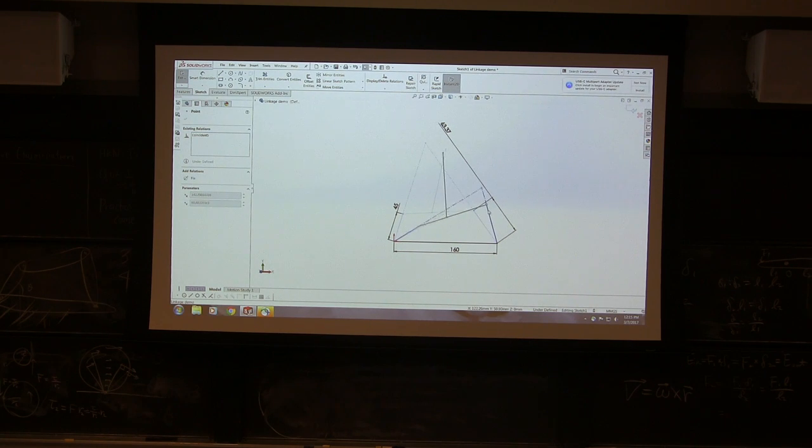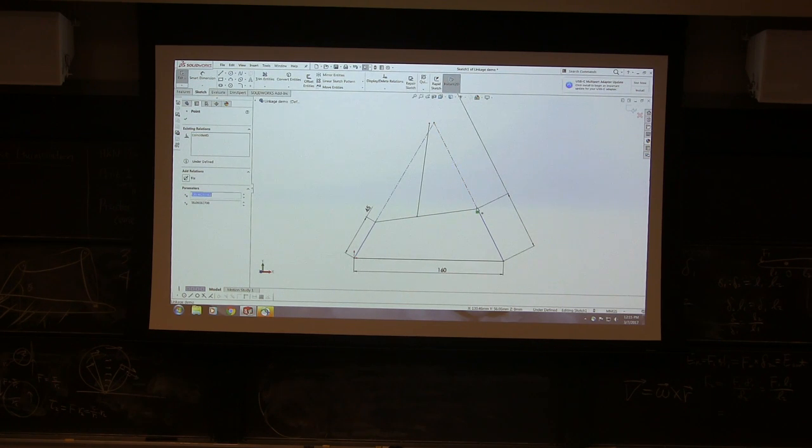Instantaneously, that middle piece is not rotating about that joint anymore, right? But near this configuration, that rigid body is rotating about that joint. Do you see that? I can zoom in a little more to see things better. When I'm rotating this, instantaneously that middle link is rotating about that point in this configuration. When I'm moving away, it's no longer true. But around this point, it's instantaneously rotating. In that moment, it's exactly rotating about this point.